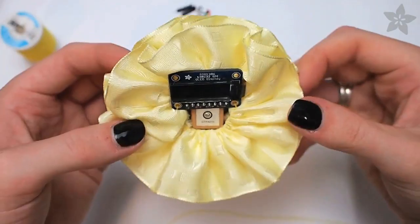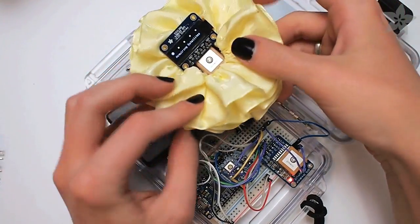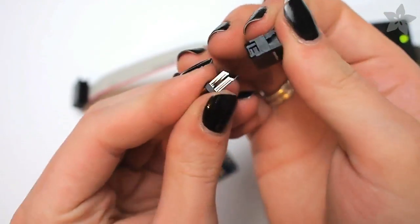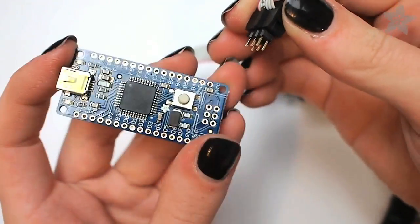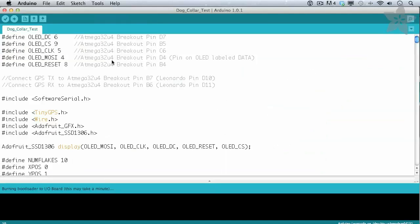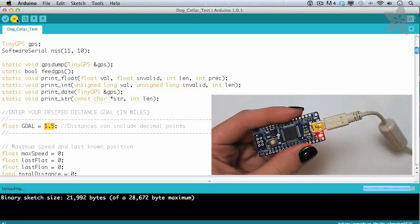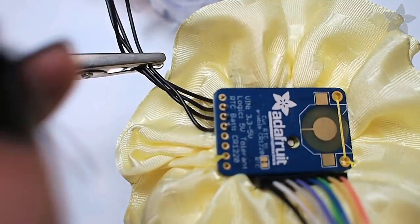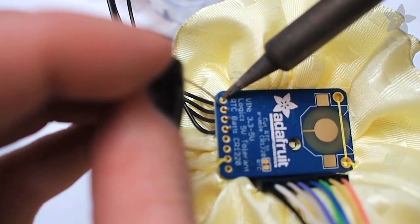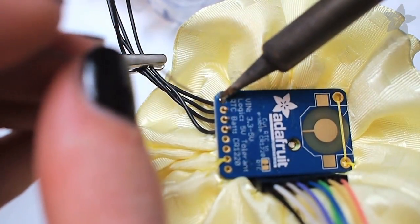For all my wearables projects I start on a solderless breadboard and build out from there, then duplicate the hardware with no header pins so everything's as small as possible. Without soldering, put the ISP headers inside your programmer and just hold them against the contacts of the programming pads to burn the Leonardo bootloader onto the 32U4 board. The code for this project is available on GitHub, and after you've burned the new bootloader you can load it onto your board with the USB cable. Check out Lady Ada's GPS tutorial as well as the comments in the code to see how to hook up the GPS module to the rest of the circuit.